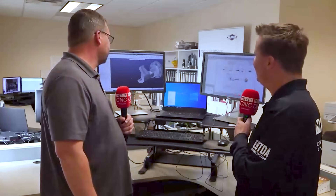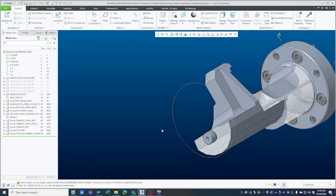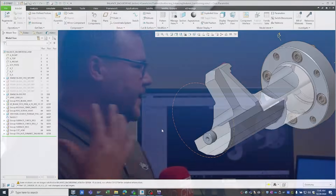When I see a tool like this, instantly I go: I haven't seen that before, or I created it on my own and it didn't quite work. You guys are doing it all here. First part, good part — that's our goal. We also have certain tools that have to reach in through workpieces. We can give the customer a cutting scheme and the whole parameters on how they need to reach in and still have a stable cutting tool, which helps them and the programmer. He doesn't have to do the math — we have it all right there. They know how to approach it on the angles, get back to zero, come back out. We do all that for them. There's nothing for the programmer on the machine builder side to figure out — we've already done that for them.